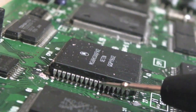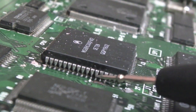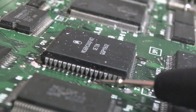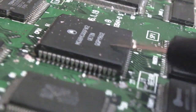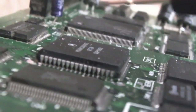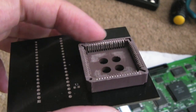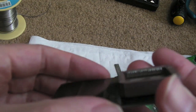The pins don't come out from the top. They come out just above the halfway line, go down to the bottom, and if you looked on the underside of this chip, it bends under and is folded up on the underside of the package. So you've got quite a big gap at the top here, and obviously it goes right down to the very bottom. So when that chip is in one of these sockets, you've not got an issue. As soon as you go the other way around and you start sticking this on top, you've got a huge problem.